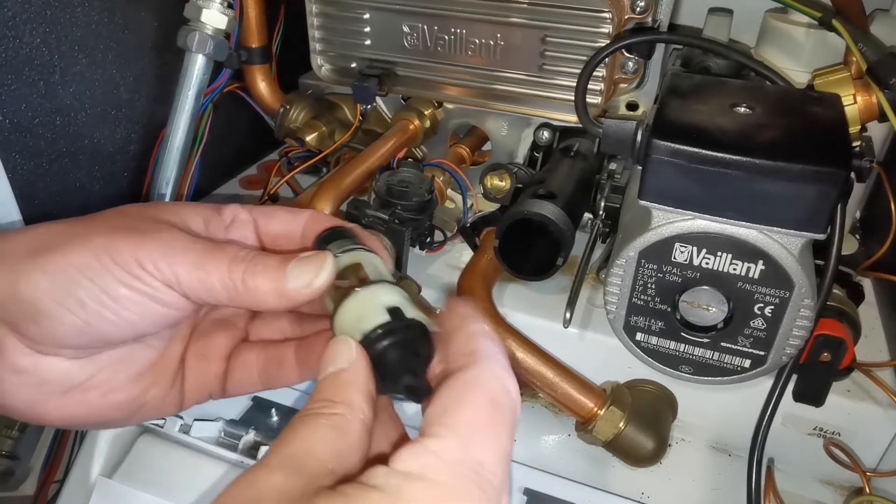Line the lug with the hole on the valve as this is where the cartridge will lock in. Then, making sure the hole on the side is pointed to the left, push it in. Using your screwdriver, turn until you hear an audible click. Give it a couple of twists to check it is securely in place and remove your installer.